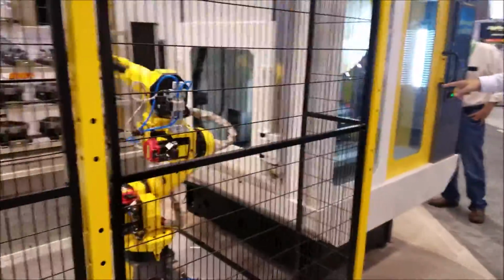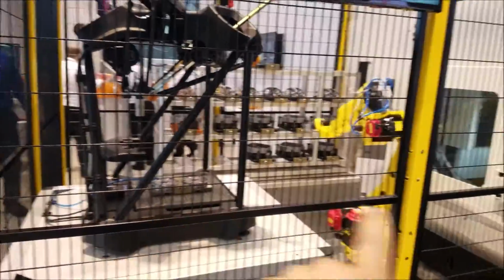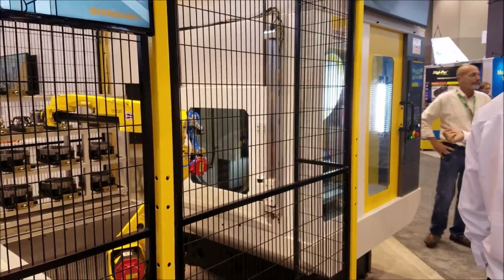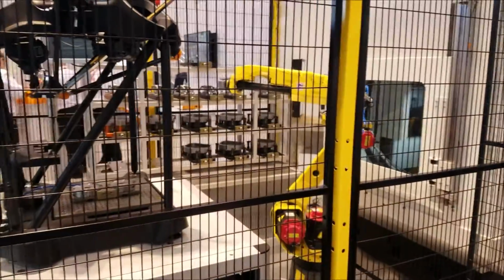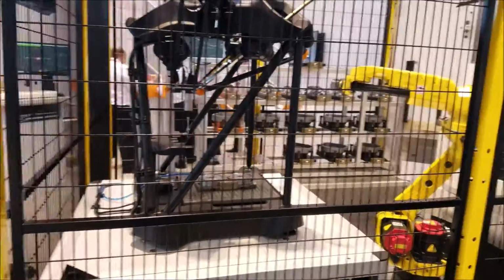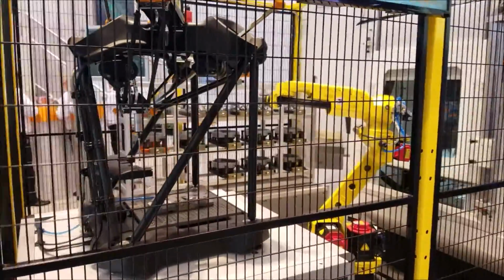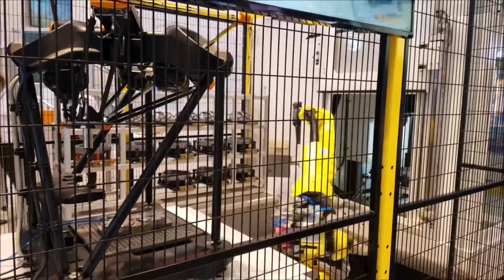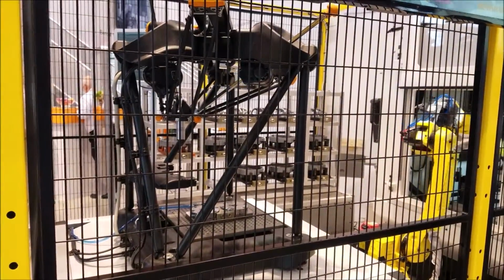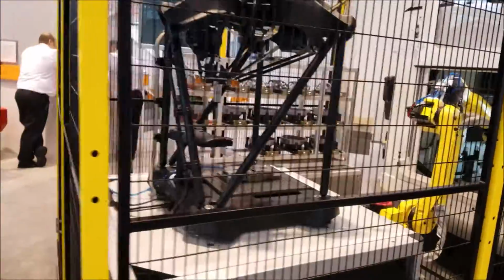Then the data. They've created an API that goes from the measurement tool to the mill via Ethernet, and the new FANUC machines come standard with Ethernet. So you can set all of your tool offsets and tool comps through that. They have this guarantee system where if you crash your tool, you can buy another one. They call it the repair and exchange program. You can buy a new tool after you crash the first one for about a third of the cost. It's pretty cool.